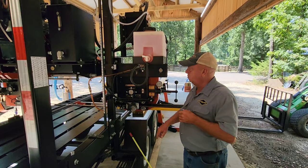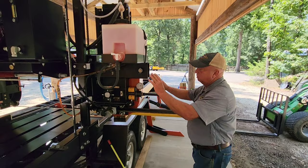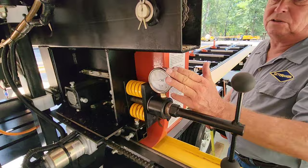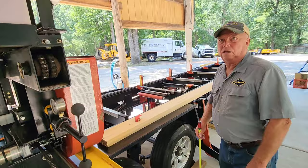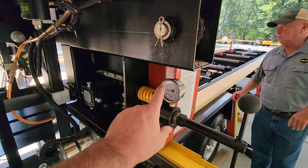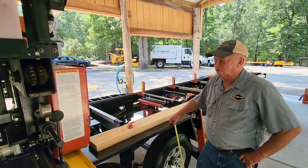I like to see what that blade is doing. I turn this 90 degrees — now I can see my tachometer, my fuel pressure, and operating pressures on the system all from the operator station. If you're running into a situation and you see this number start climbing, it means your blade is probably rising. Just keep an eye on your gauges — it can help diagnose actual issues. These changes are done for one or a combination of three reasons: to improve the productivity of the machine, enhance long-term reliability — hence these different breathers and additions — and also to enhance safety.